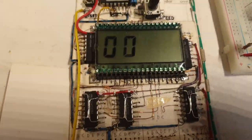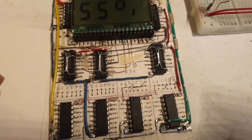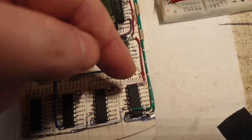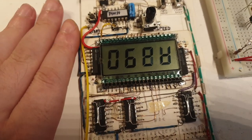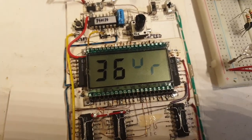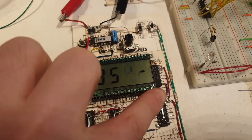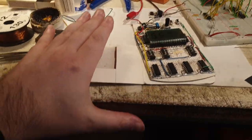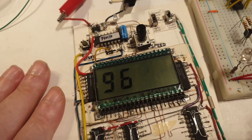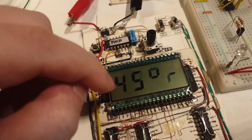Check this out — it's clear as a whistle now! The two remaining digits still show errors but that's simply because they're not connected to their chips yet — floating inputs cause that. If I touch the circuit or put my hand on the iron table which is grounded, it clears them. If I'm not grounded they reappear. That's not a real problem — it will be resolved. The actual stupid mistake causing the contrast issue: in all my electronic experience, sometimes a pin springs out from the board less than one millimeter and floats without making contact.